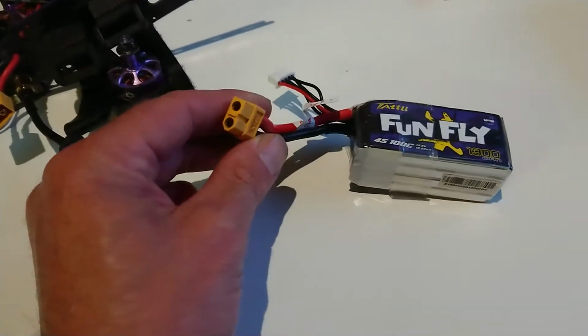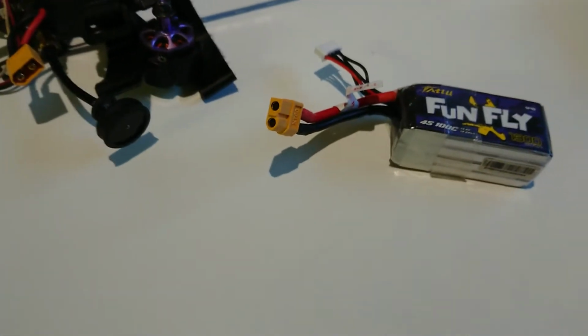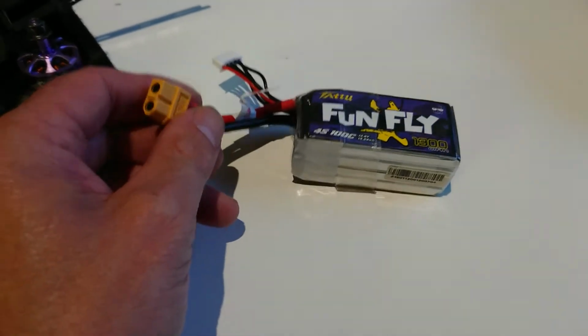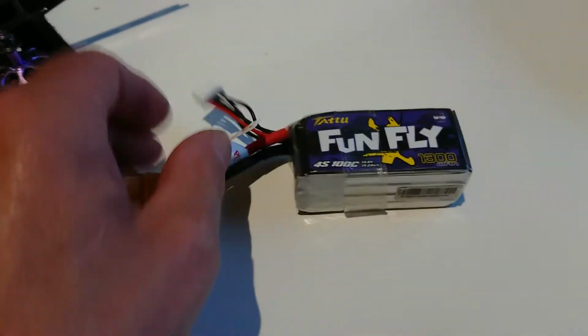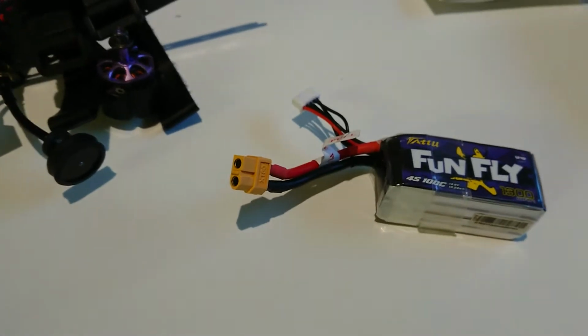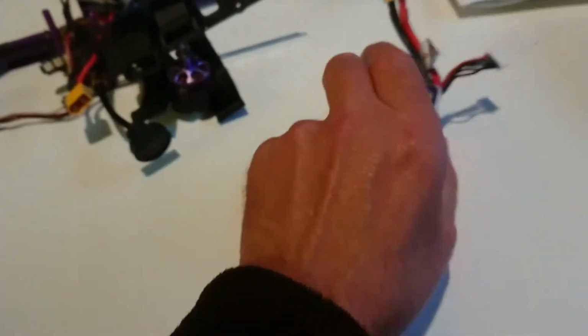Put it on 0.1 amps on PB, just on this, obviously, don't bother with the balance cable. Watch the voltage on the screen go up to, I think when it just gets over about 11 volts, you can shut that off. Connect this up and go back to LiPo, and then it might take a charge and you just might recover your LiPo batteries, but I'm not advising that, but it works for me.